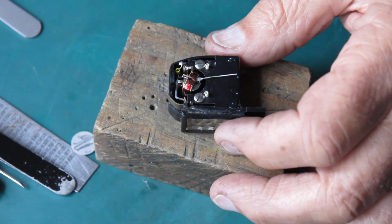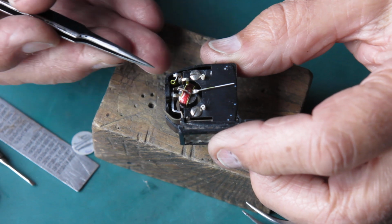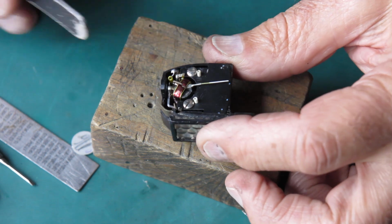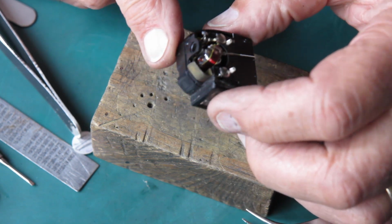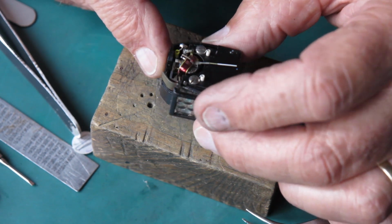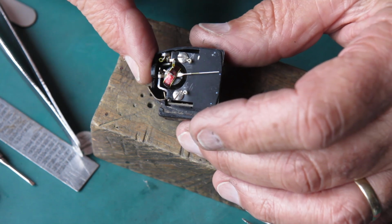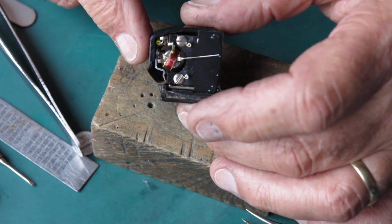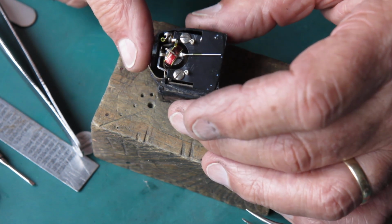Well, I've spent a lot of time peering closely at this, and from what I can tell, the upper pivot is broken. On the inside of the coil there that you see on the meter, there's a tiny needle top and bottom. They're the pivot points, and they drop into little tiny recesses or cups on the armature, on the shaft, which you can adjust up and down to. But what's happening, I think, is that the top needle's gone. It's snapped off, so that when the cup rises up, it's not lifting against the point of a sharp needle. It's just hitting the body of the coil there.